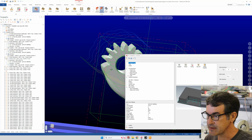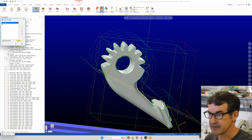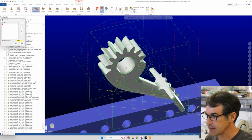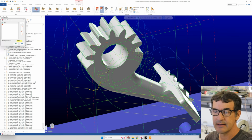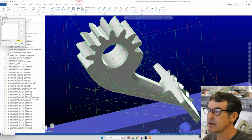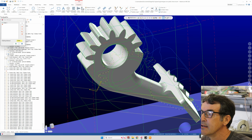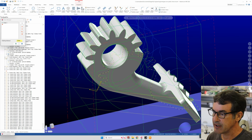So if we go to parameters, toolpath, and then chain geometry, and then figure out what chain we used, you can see how I drew this profile, which is this black and yellow profile. I did that by going to the wireframe section, and there's something called project. So you can pick a plane to draw on, and then you can click on 3D features, and it'll project those features onto your machining or your sketch plane.